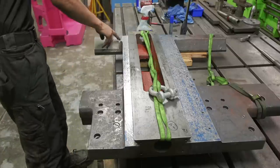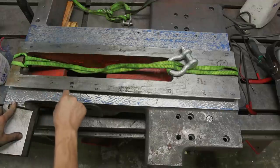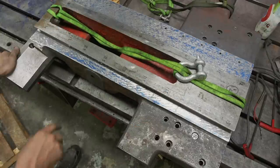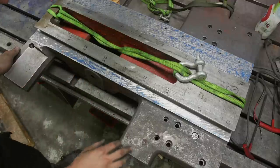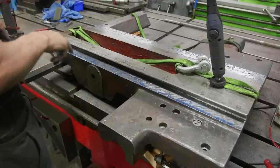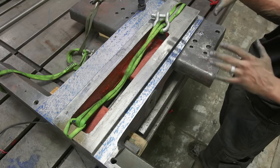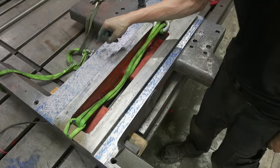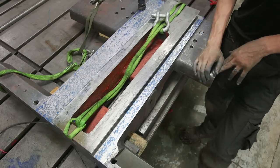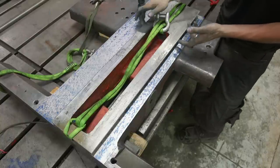We got the carriage flipped around and are starting on this side. Our base is at zero and our high is at two. Not bad for a first print — we're bearing here and here, with decent contact and a little bit there. After quick adjustments, that's looking a lot better. Here's our third print — still heavy in similar areas but migrating out. I'll work this off camera for another ten to twelve steps. Overall this is looking real good. I took measurements off this surface and we are very, very close to the same amount of metal removal on both sides, so these should be close to parallel.